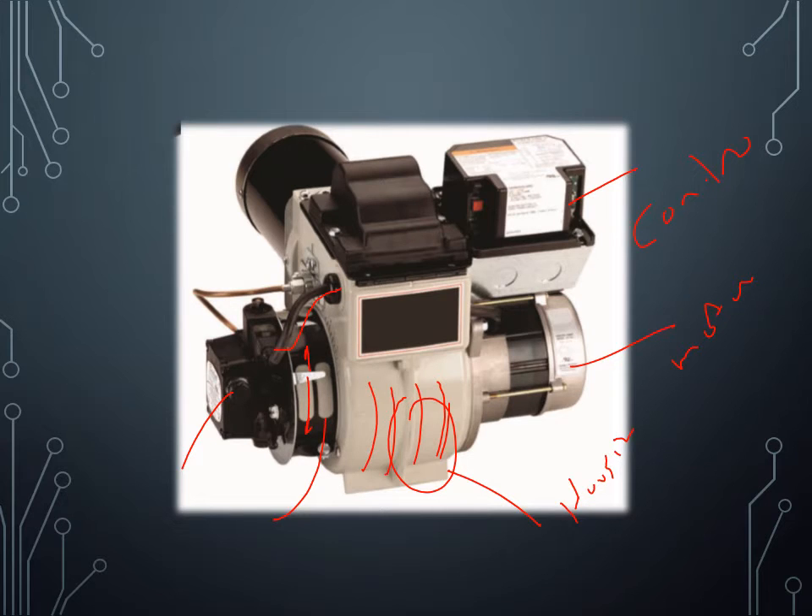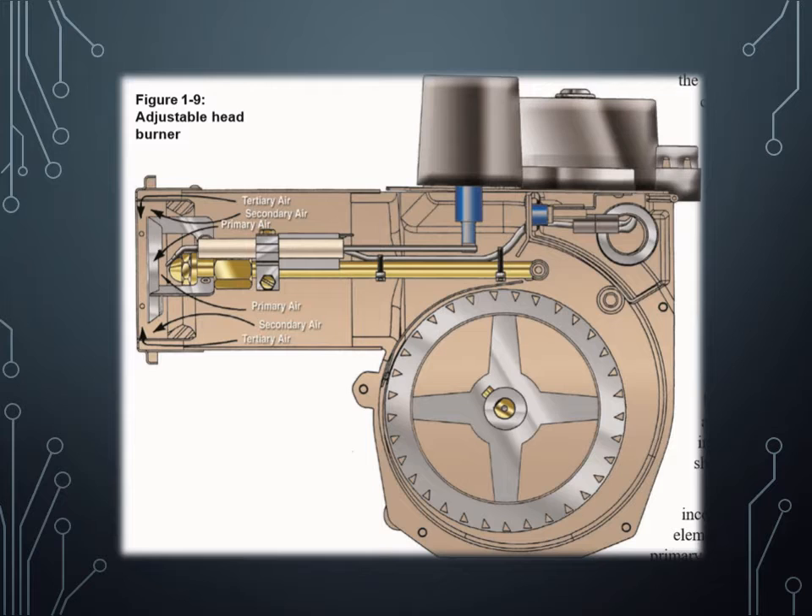This is my connection to the oil valve — this is my oil valve that opens the oil coming to the pump once the control approves it. This here is my nozzle line. This is called the air tube, and this is the igniter. The igniter can be either electronic or a large transformer — this is an electronic igniter, which is very lightweight, while the big bulky one is the transformer. Looking sideways inside the burner, you'll see the electrode igniter or transformer, which is supposed to hit the bus bar, and these are my electrodes.